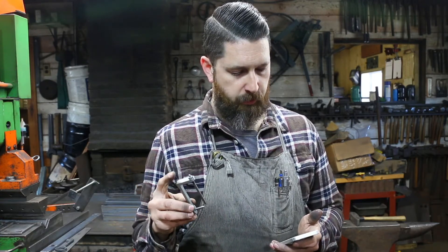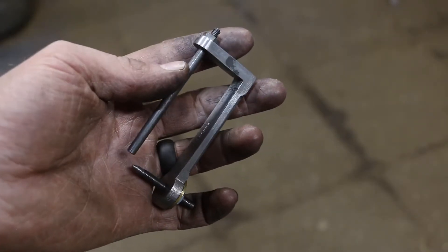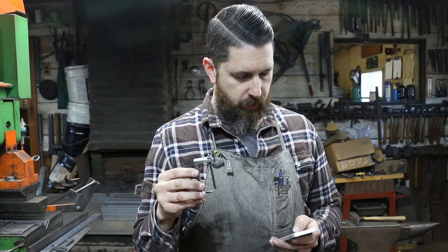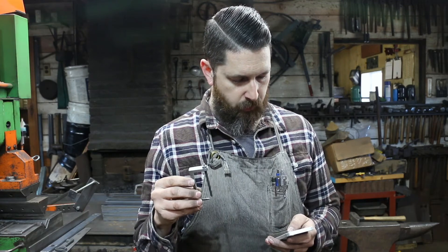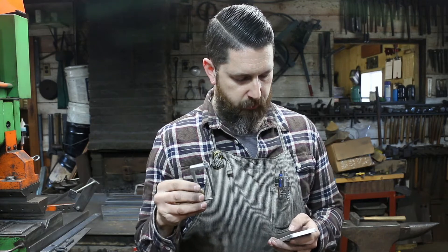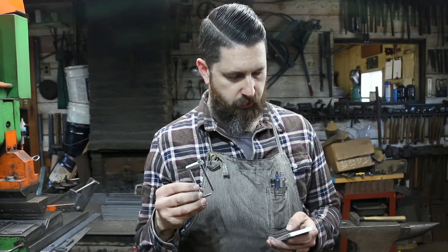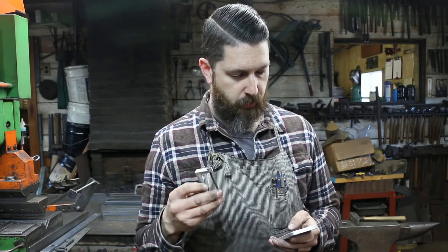The gauge is composed of an iron strip folded at a right angle. One of the legs of the square is about a third shorter than the other. At the end of the shorter branch there is an iron pin parallel to the larger branch of the square. Finally, at the end of the longest branch there is a nut which allows an iron tip to pass through, so the tip of the screw is brought closer to or further away from the spindle. Here's how to use this tool: we put the pin in the gauge of the keyhole, apply it on one side against its wall, and bring the tip of the screw close until it touches the key outside.